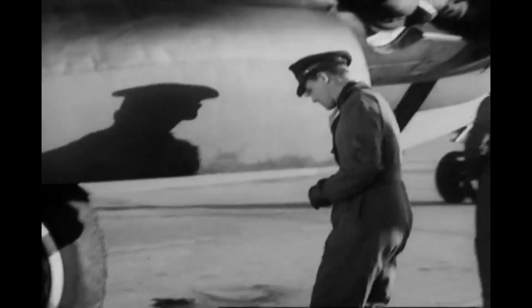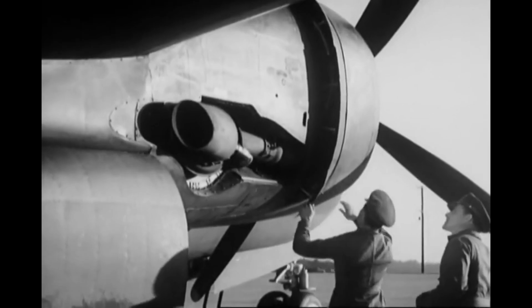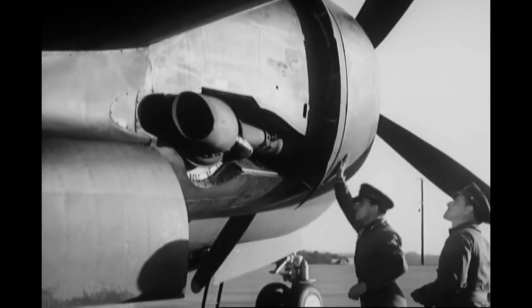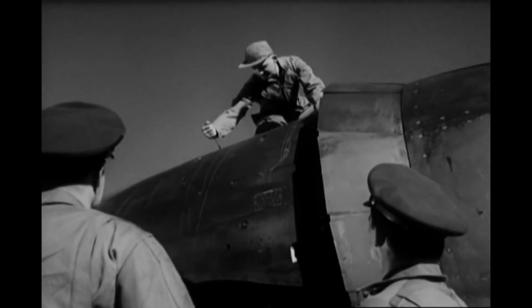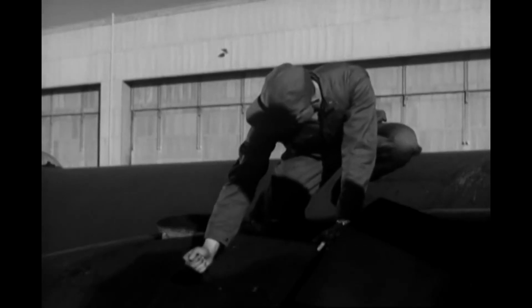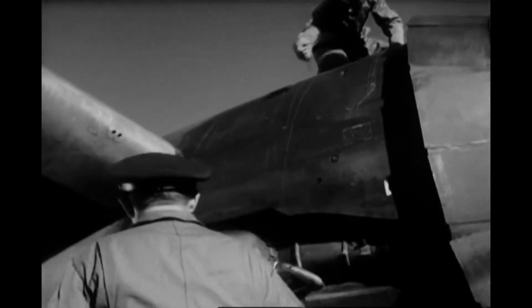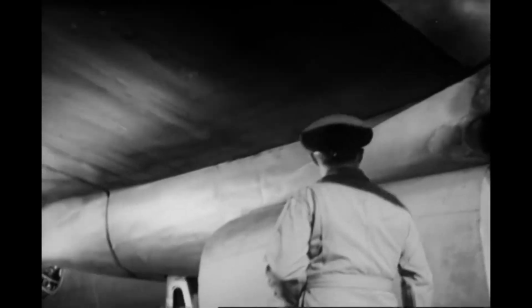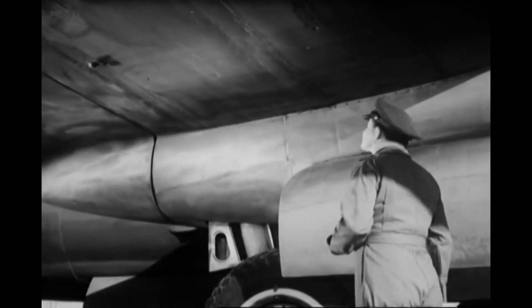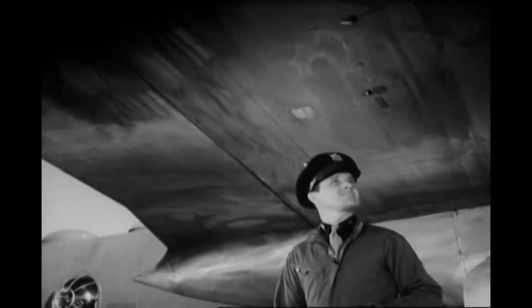Next, check the cowlings, inspection doors, and inspection plates. You've already examined some of them, but you must be sure all of them are okay. The other members of the crew help you out with these inspections. Here, for example, a gunner tests the fastening of the top cowling. But you'll have to check the security of the other coverings, and there are a lot of them all over this ship. While you're walking along, you can examine the wing seams. Fluid leaking from them means trouble.